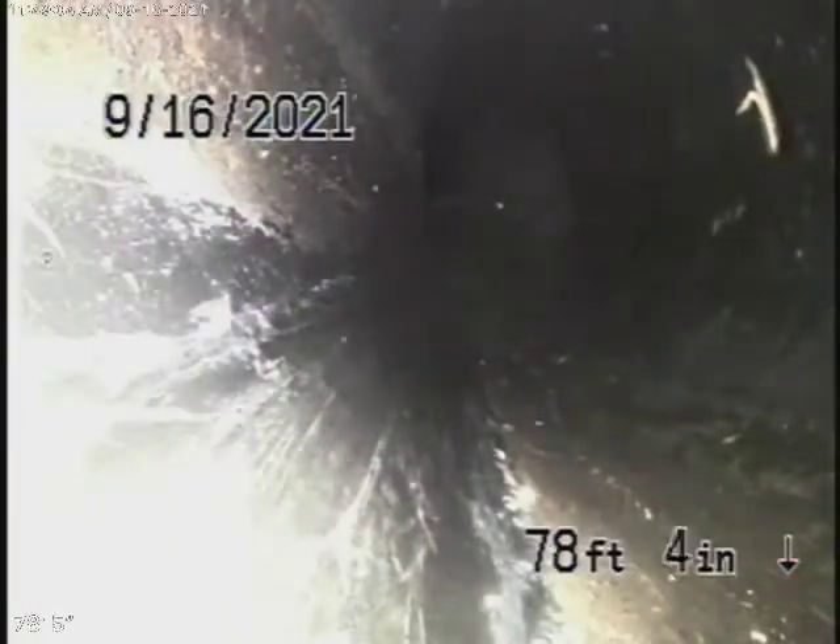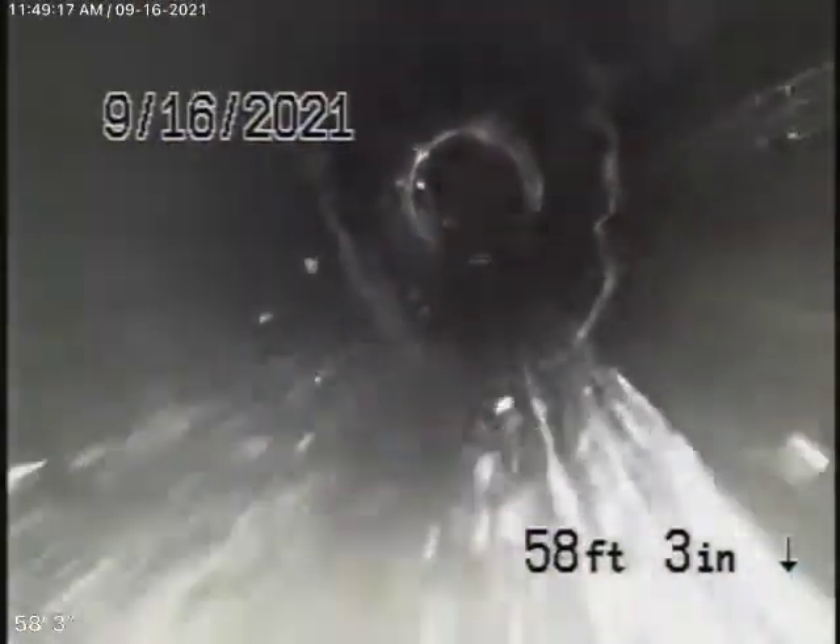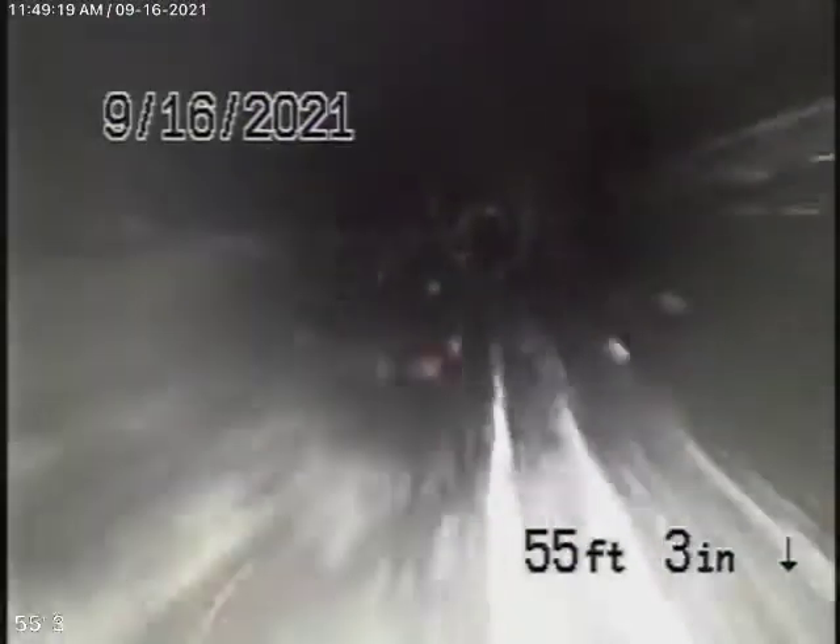There's just a little bit of roots right at the end of the ABS plastic where it goes into the clay pipe. Nothing serious — nothing that's going to cause any blockage at this time. You may need cleaning sometime down the road, but on the whole, the sewer line is in good condition. Whatever you do, don't flush tampons, baby wipes, paper towels, things like that.